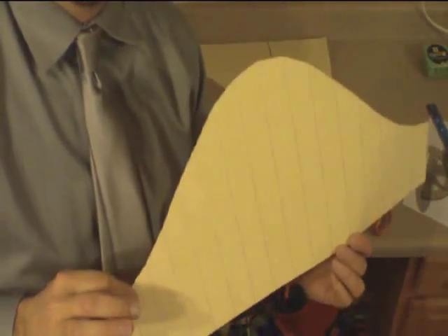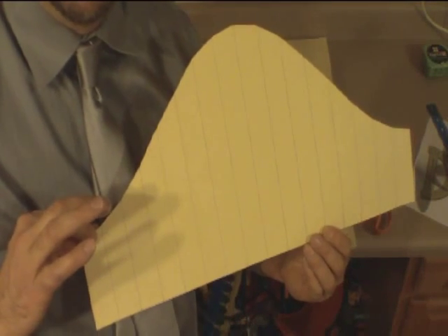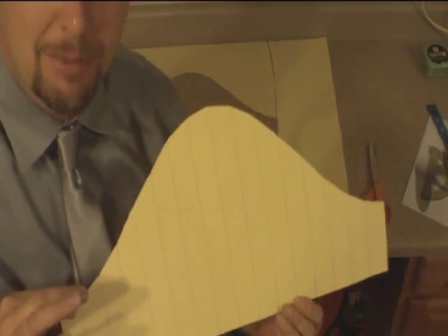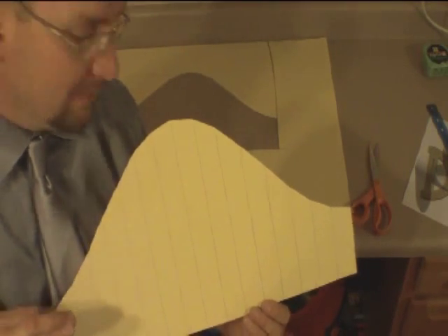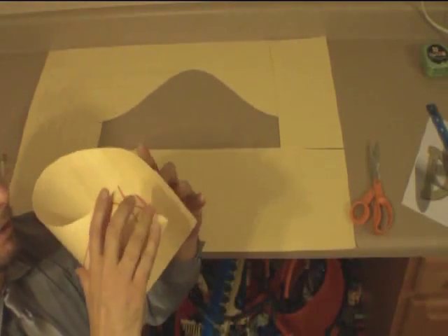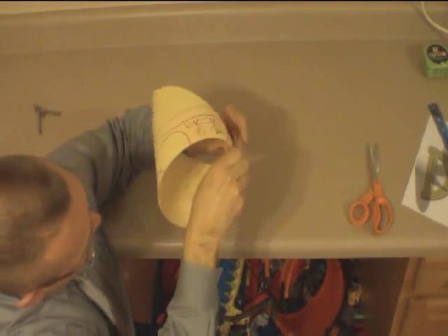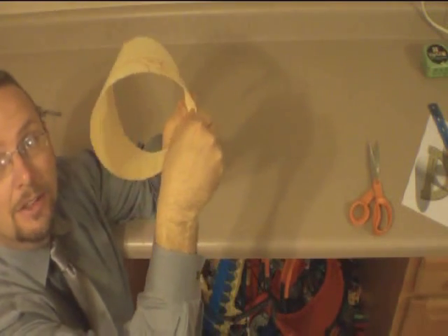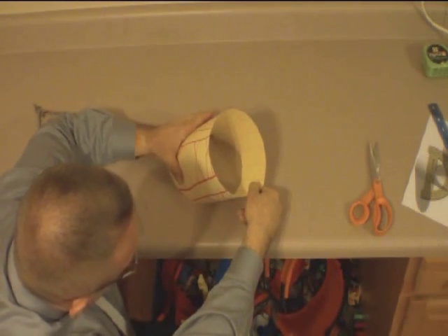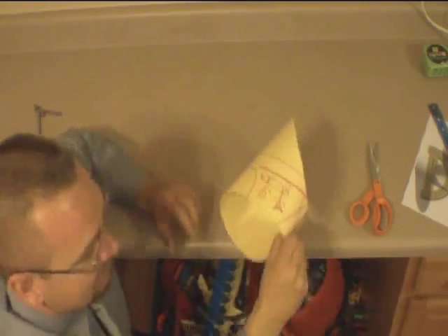Here you can see my perfect 45-degree cut sine wave angle guide for a 6 and 3/8 inch stove pipe or any 6 and 3/8 inch cylinder. That's how you would do it for pretty much any size pipe and any angle. Now if we wrap this into a perfect circle and tape it, that should equal 6 and 3/8 inches - and it does. If we set it right here, looky there - she sits perfectly flat at a perfectly cut 45-degree angle. And that's how it's done.